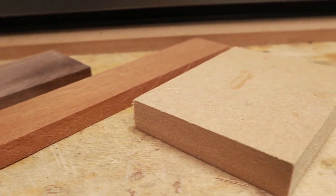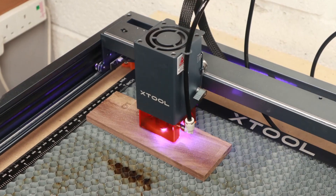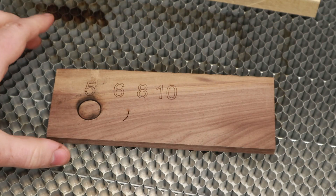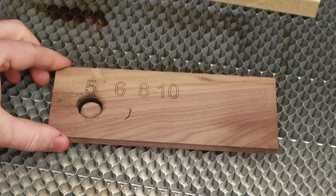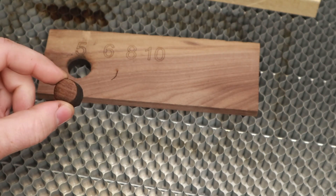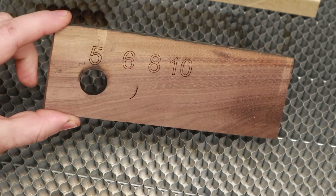On to the next test — I've lined up four different pieces and thicknesses of wood: 10mm walnut, 12mm sapele, 18mm MDF, and 24mm thick poplar. I've programmed the laser to cut a simple circle to see how many passes it takes to cut all the way through. Looking at the walnut, in five passes it did cut through — it actually only needed three or possibly four passes. Because it did the full five it's charred a bit on the bottom, but it has left quite a nice circular cut-out.